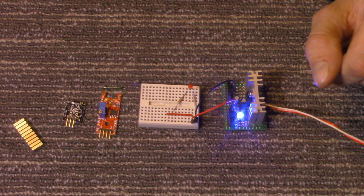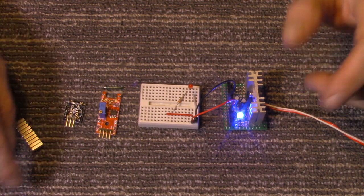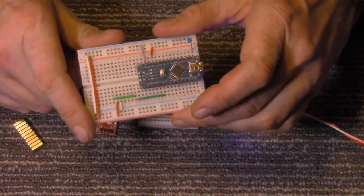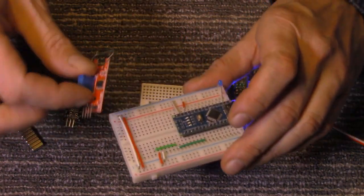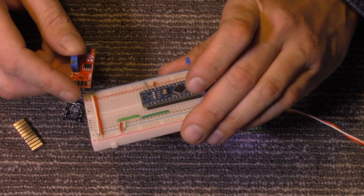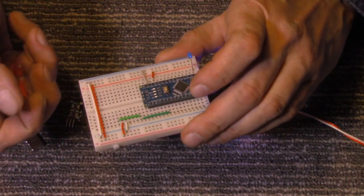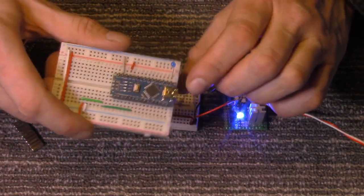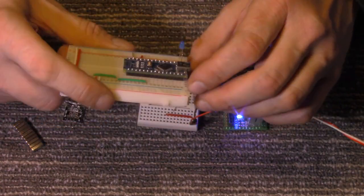And once again, you can look down below in the description, and I'll have that sketch for the Arduino code if you'd like to put that together and try it yourself. And that's just, we're using the digital output on the board, goes to pin 3, and then I have the positive and negative wired up on the breadboard for the little breakout board. And then I just got an LED on digital pin 13 because it has a resistor already built in, so I didn't have to put a current limiting resistor on here.